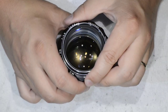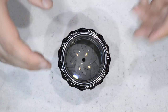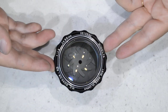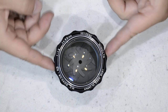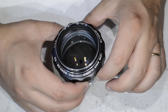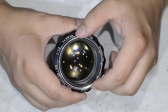This lens was sent to me from quite far away, from the United States — the first time I get a lens from so far away for repair. The first issue was that the diaphragm was oily and actually blocked because the helicoid grease had separated, pushing all the oil into the diaphragm. On the helicoid itself you get only the soap residue, and at some point that produces very stiff focusing. So that was issue one and issue two.